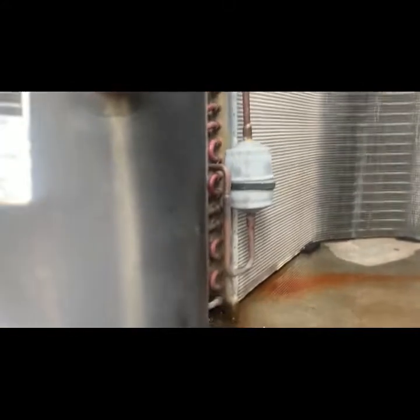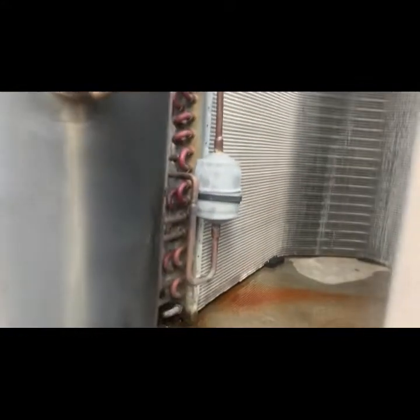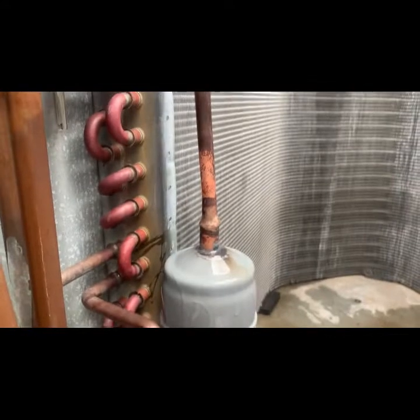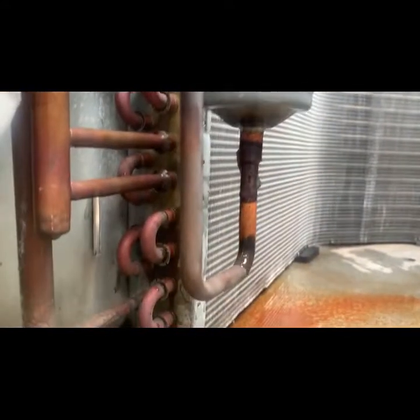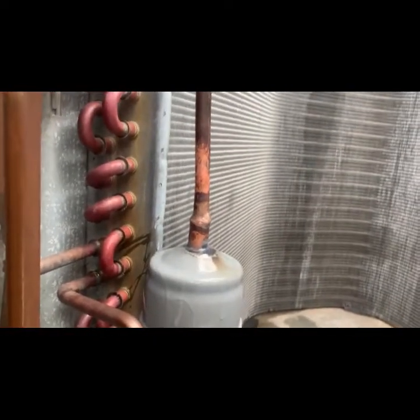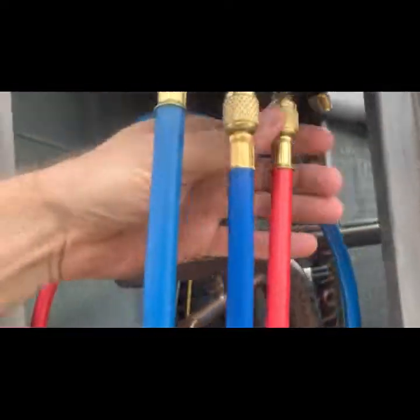In order to change that I actually pull this whole top off, which works because I've got some guys with me today. We'll pull the whole top off, make sure I've got that dryer. We're going to recover the refrigerant, change her out, pull a vacuum — all that fun. She's airtight; we already leak tested it with about 150 psi and she's good. Now we're running the vacuum while we've got the system off.